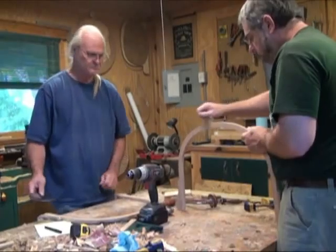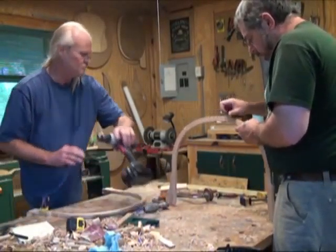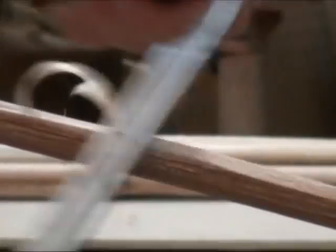There are 45 holes in a Windsor chair — that includes the legs, the stumps, the spindles, everything. They're all drilled by hand with a brace and bit. There are no nails or screws in this chair; it's all put together with socketed mortise and tenon joints, all wedged and glued. These chairs can take a lot of abuse. They originated in Philadelphia in the 1760s, and I have actually sat in a chair built in 1790 that was just as tight and just as comfortable as one of mine.